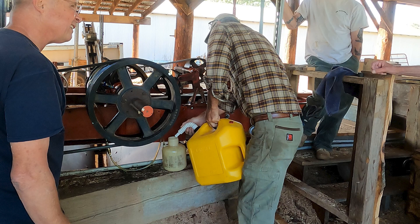Just a quick explanation. What Alan's doing is he's putting some diesel fuel, aka kerosene, into my little pressure pot. That little thing is actually used for pressure bleeding hydraulic brake systems on cars and trucks. It works swimmingly well. I made up an adapter which fits into the Zerk fitting, and this way I can pump kerosene into the bearing pretty aggressively. We pumped in several gallons of it. A lot of dirty stuff came out of it. Does it help any? I'm not sure. Certainly can't hurt, but now we've got to regrease it.